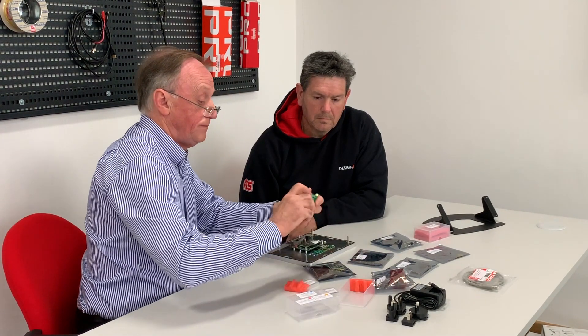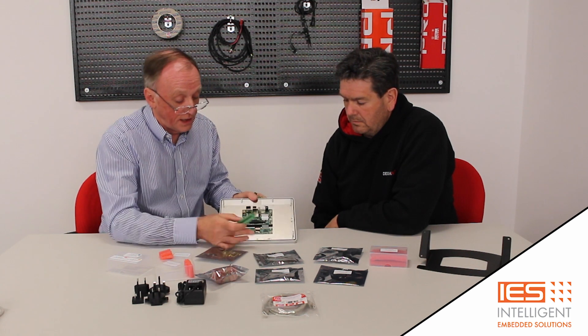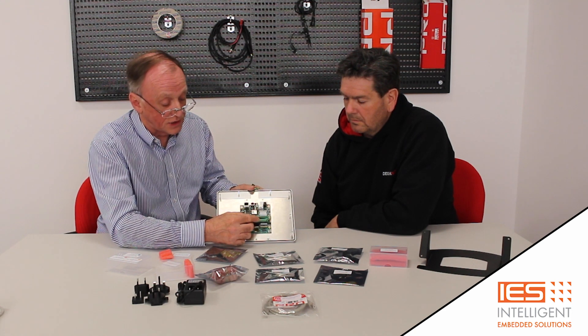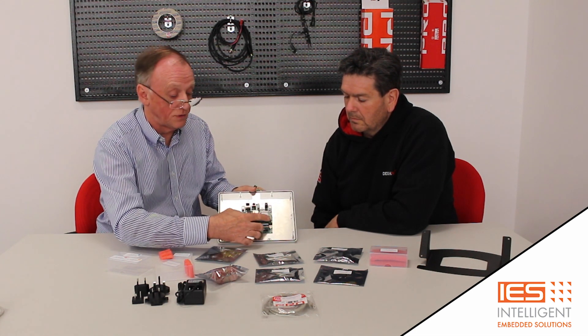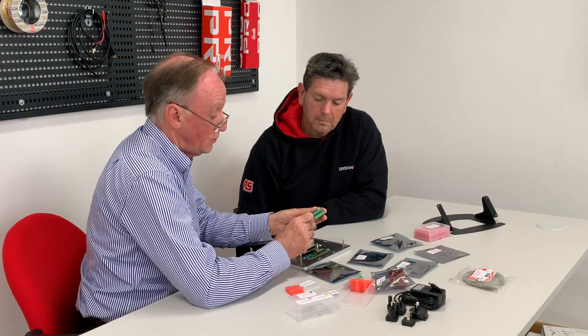The other standard connector is the screw terminals. If you don't need most of the connectivity or you've already made your own cable assemblies, that's the easiest one to use. When plugging in, be careful to align the 2mm connector correctly — check the mounting holes on the side and make sure they're properly aligned before pushing in and getting the screws in. Don't misalign it, power it up, and damage something. There are also dual CAN controllers on there, fully CAN compliant, using SocketCAN in the operating systems, plus an accelerometer as well.